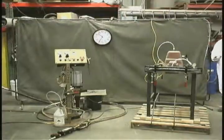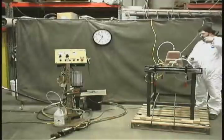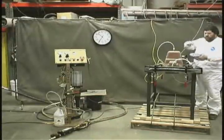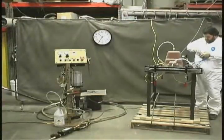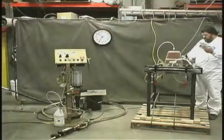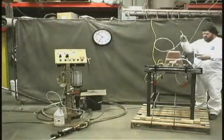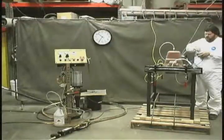At this point, those clamps are virtually not doing anything at all. The blue line represents a regulated vacuum. You'll see Don connecting the blue line to a catch pot. That blue line could actually be connected directly to the mold at the top; however, if we were to draw resin up into that blue line, we'd potentially draw it into the regulator and up into the vacuum system.